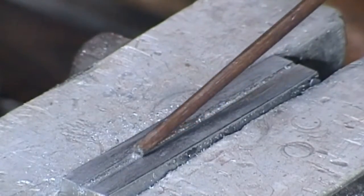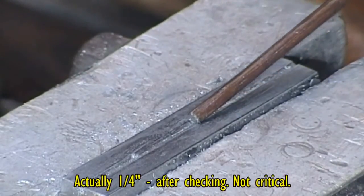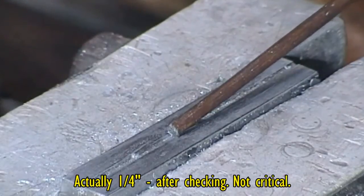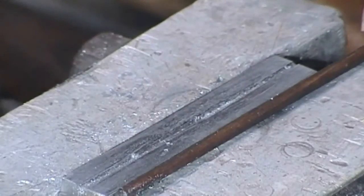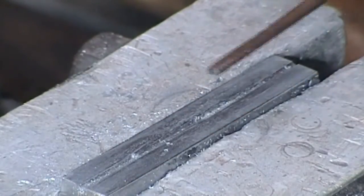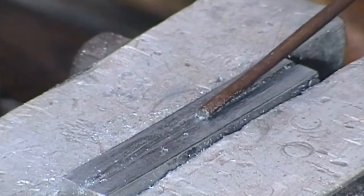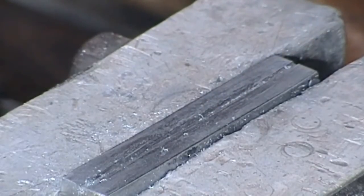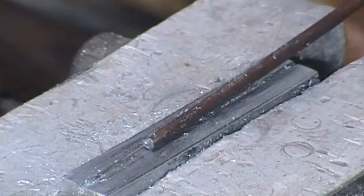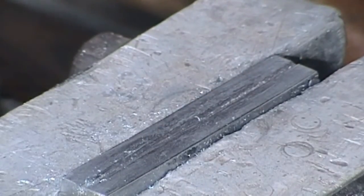I've got a piece of this, about 3/16 material, I think, slightly thicker, been trimmed down. So what we've got is a piece that's about nominally half an inch wide. Try and get a groove down the middle, which I've started, and that's the difficult part, very much the difficult part. This, if I didn't already say, which I didn't, is to put in the tool post to take something round like a boring bar, just to give you a firm base to get it locked up.